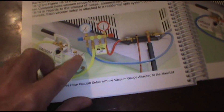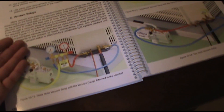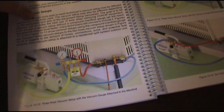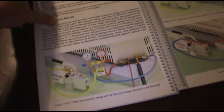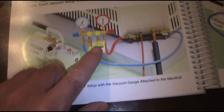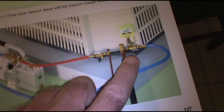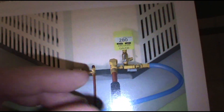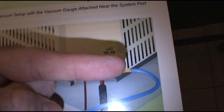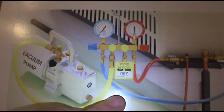This is what I needed to tighten up on — my vacuuming stuff was just bunk. I'm self-taught; I followed an old-school guy around for a little while, but when you're in maintenance you get told things like 'put it up to 70 psi, that'd be good' — no superheat training, no subcool. I started putting my micron gauge on the valve, but one time I broke the wings off a valve core trying to get it out, so it was just a stick inside the service valve and I couldn't do anything.